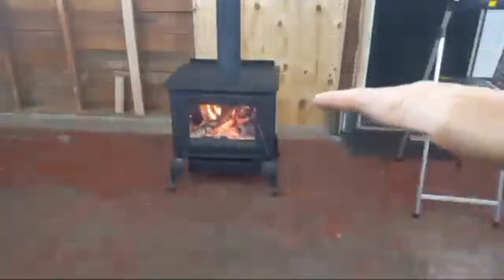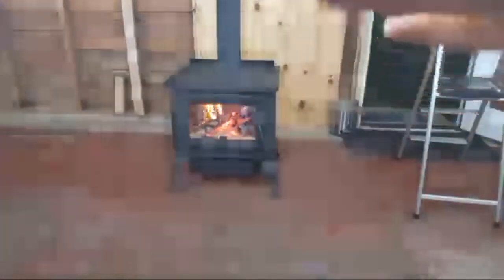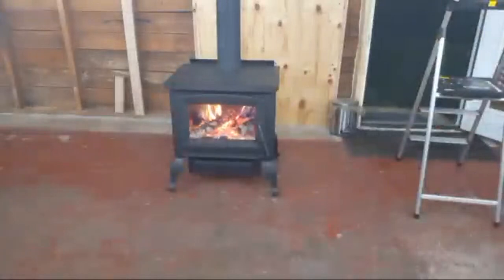Because the baffle was pushed to the front, all that smoke was coming to the front. Inside the stove it's actually angled coming up as you move towards the glass from the back, so it vents that way more easily than going up to the back the way it was. A bunch of smoke was coming to the front and that's what caused the issue.